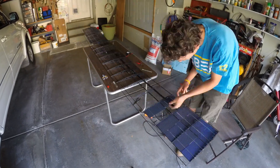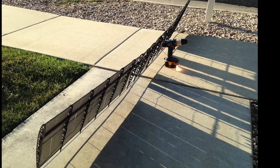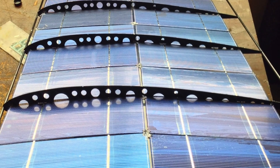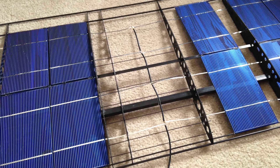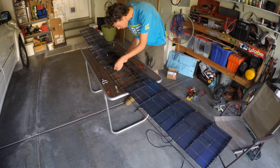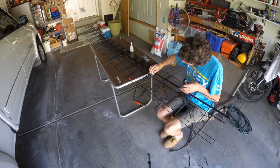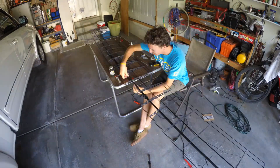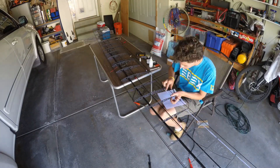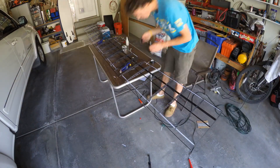Installing and soldering the solar cells is tedious work, but I got it done. Here you can see the wing is powering a 50 watt halogen bulb with no problem. I then realized that there could be short circuits between the solar cells because they are mounted directly to the carbon, and carbon is very conductive. Even though the wing seems to be putting out enough power, I decided to remove all the solar cells and insulate the carbon. This took a very long time. I used liquid electrical tape for the ribs and spar, and paper held on with CA for the thin tubes, because it offers more strength than liquid electrical tape once the cells are glued back on.